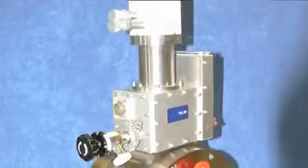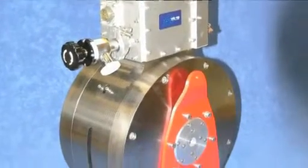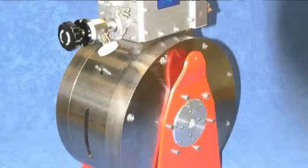Carrying more current can, for example, allow you to create a high field electromagnet with less wire, with less windings — therefore it can be smaller and lighter. You could also create a transmission line with a much smaller cross section. All these things are desirable; making your devices as small as possible makes them cheaper and easier to cool.